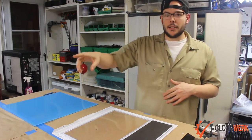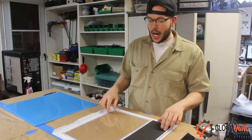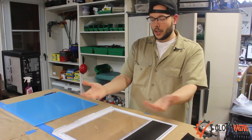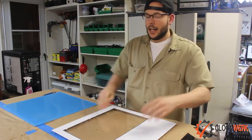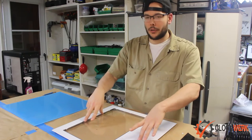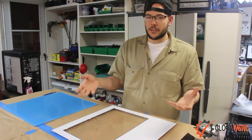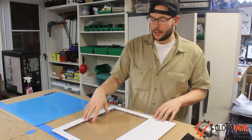This will be cut out on the CNC machine because, like you saw in the other video, I need to make a pocket around the outside of the window, so when I seat it into here, it'll sit flush with this side of the door panel. Then I'll head over to the laser cutter, cut out my trim pieces, and glue the trim to the window panel, sandwiching the metal in between the trim and the window. That way, the window is essentially locked into place with the trim. It's a nice, clean, professional look on the window install.